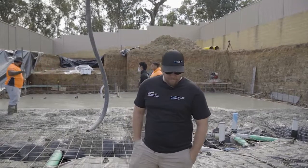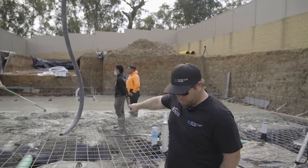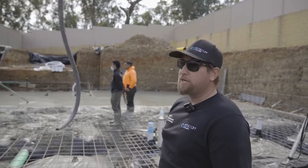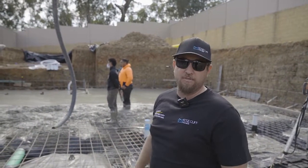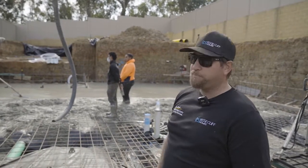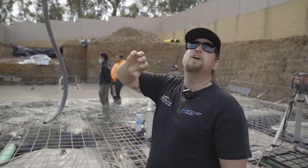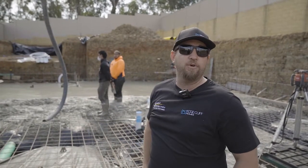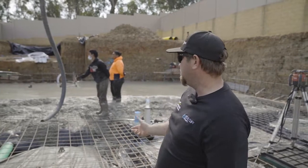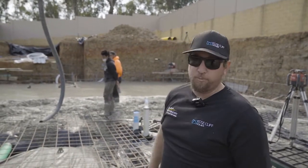As you can see, we're down in the basement now. Over the top here we've got the boom pump. The reason we use that is ease of access - it's nice and easy for the boys to work with, better than the line pump. With a line pump you'd have to be dragging the hoses everywhere. Being a boom pump you've got an aerial, it's nice and easy. Just grab it, put it where you want it and easy for the boys to work with.